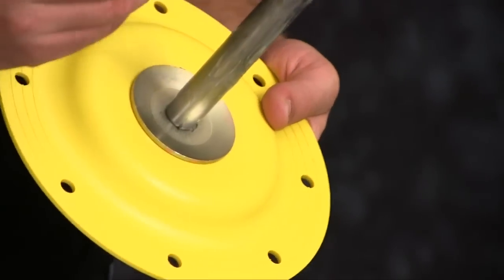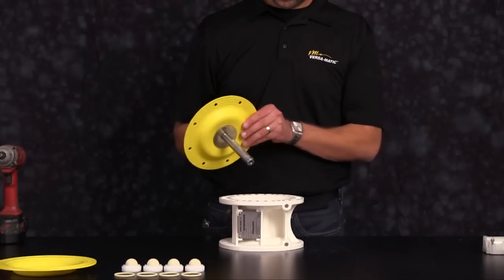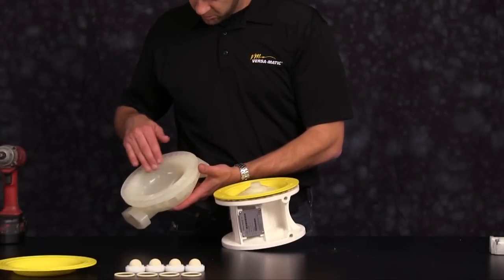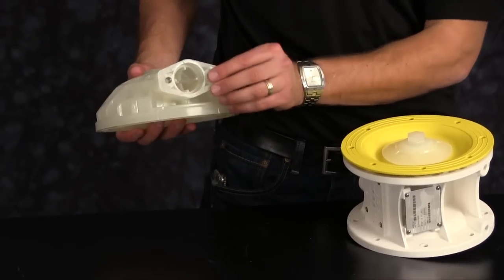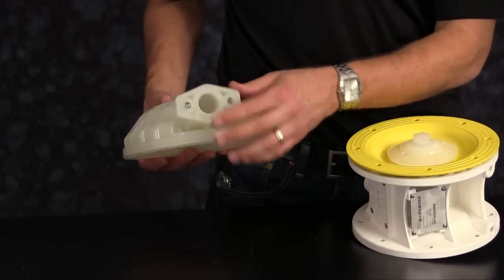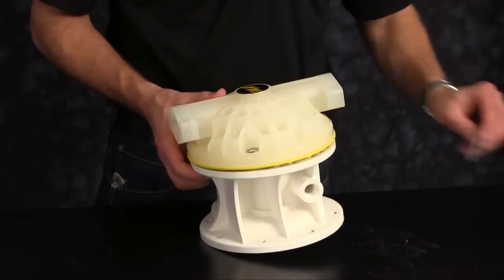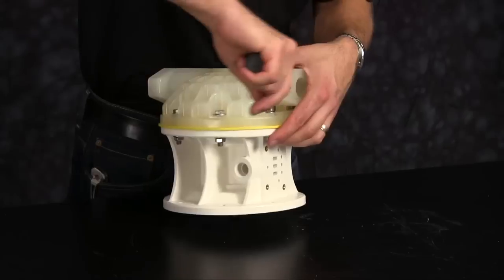Apply light grease to the main shaft so we don't damage the main shaft o-ring upon installation. Now inspect the outer chamber — inspect the integrity of the casting and the radius that the diaphragm rolls across. You can dress up these edges with light sandpaper, crocus cloth, or emery cloth. Inspect the ball cages on the suction side for any sharp edges and lightly sand. Chamber orientation requires the discharge side of the chamber to be installed in the same direction as the air valve face on the center block. When tightening down the outer chamber bolts, tighten in a cross pattern and torque to factory specs.